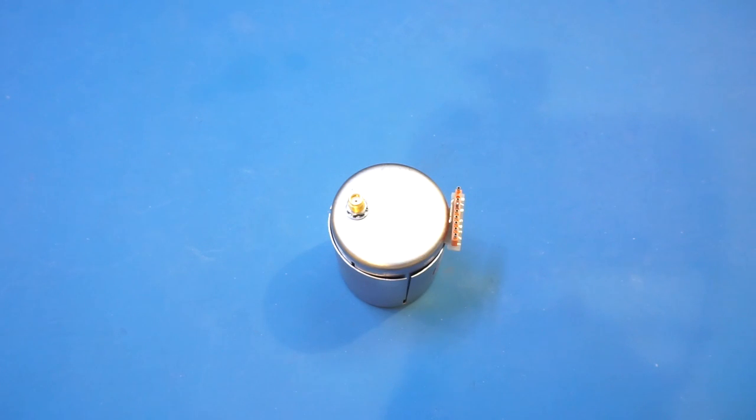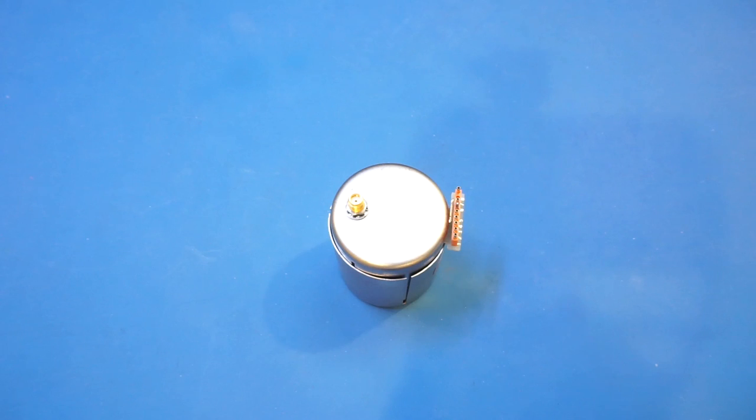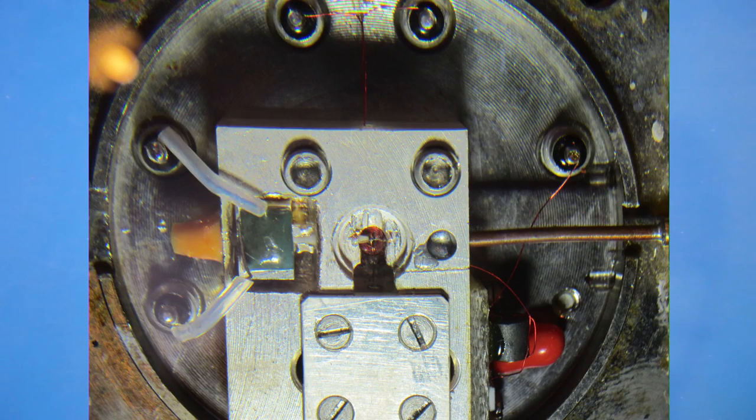The magnetic fields required for tuning are usually generated by a relatively large electromagnet. The large coil visible in this picture is the main tuning coil. Depending on the design, some smaller YIGs — especially those that don't require a wide tuning range — can utilize a permanent magnet with a smaller coil for fine-tuning the frequency. There is also another coil towards the center near the YIG sphere in the Wavetek 907, and that much smaller coil is called the FM coil, used for frequency modulation. It fine-tunes the frequency by generating a small magnetic field superimposed on top of the main tuning coil's field.